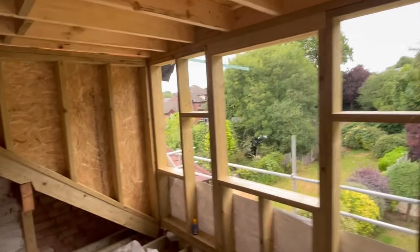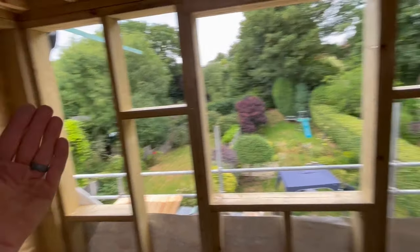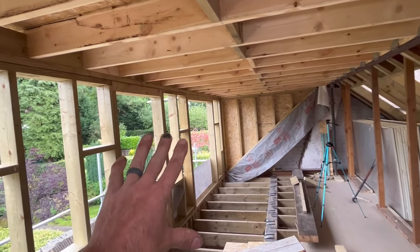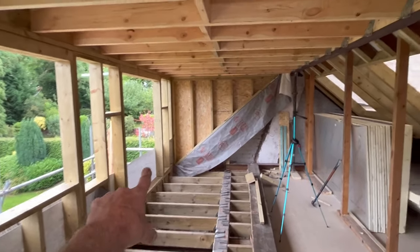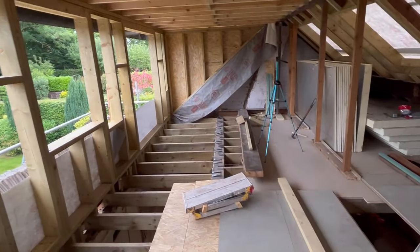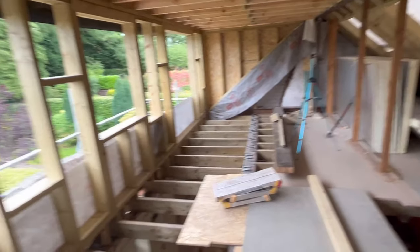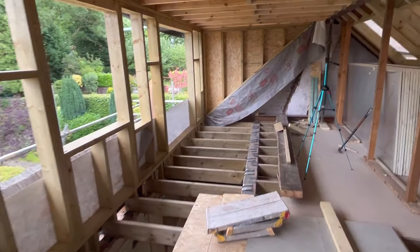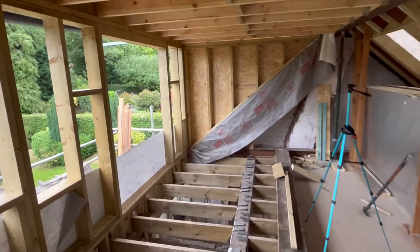What we're going to do is put about three six-inch screws into each of these on each side, and probably four into that one, up directly into the head plate. So that's us then. Tomorrow we'll be moving on — plywood in all the face of this, then we'll get the wrap we've got left over and wrap all the way around to get it watertight. The rubber roofing has just turned up downstairs along with all the trims — a very good product, quite easy to use and looks really tidy when done.